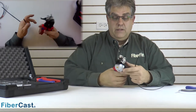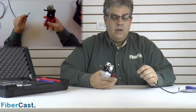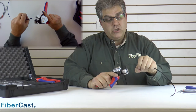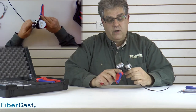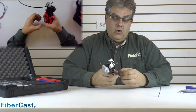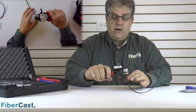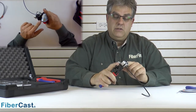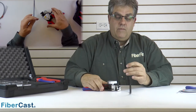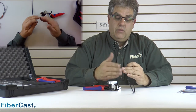The first thing we do in this particular application is kind of backwards from the normal — we actually finish or polish it prior to putting the connector on. There's a reason for that, because what this tool does, and the reason behind the patent, is the swage — the compression cutting that we do for the fiber. In this first slot in this tool, it can hold both of the cables together and squeeze them very tightly around the actual core fiber. That's what the pliers are doing. The secondary function is that the razor cutter can come through while everything's compressed and do the cutting, which gives you an almost perfect sheer cut across the fiber — you don't get any break like you would normally get with a standard razor blade.